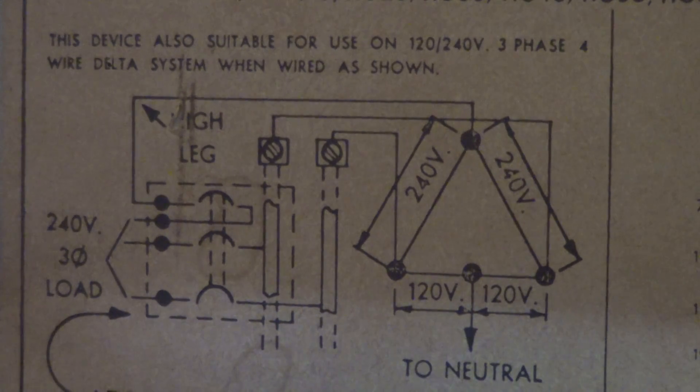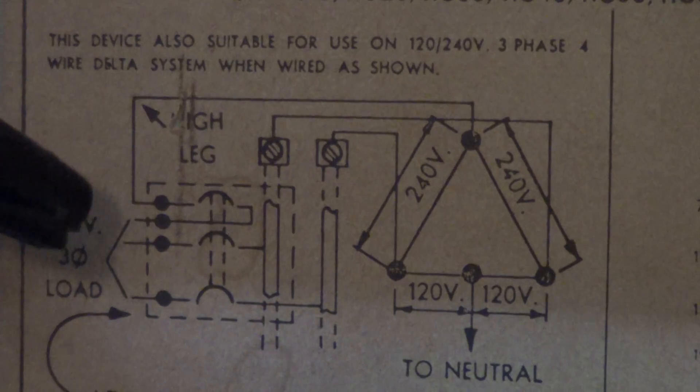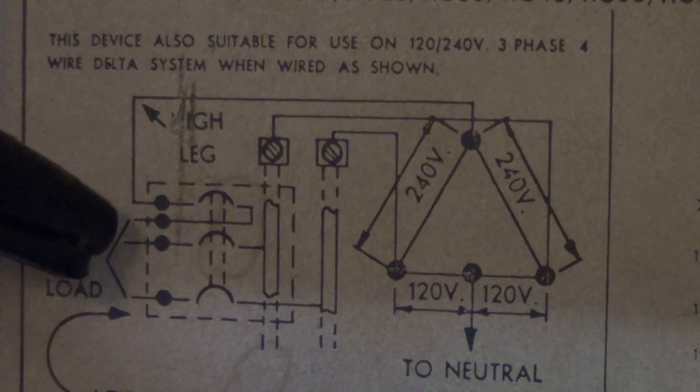This is just an ITE panel. If you wonder what this means — as a kid I used to see that and wonder what the heck it meant — that's for the high-leg system where you get 208 volts to ground. This allows for generally one single three-phase load.